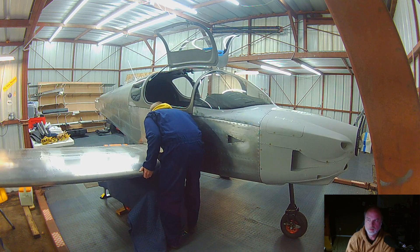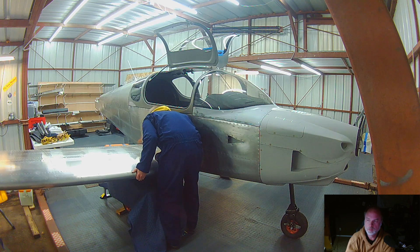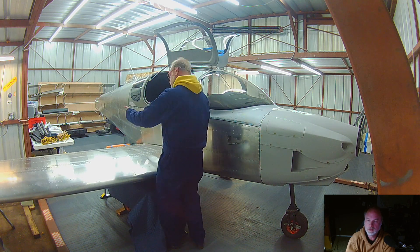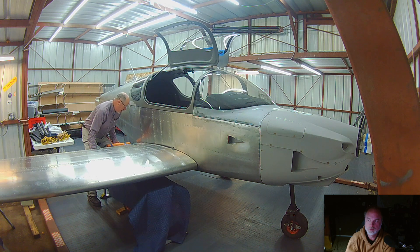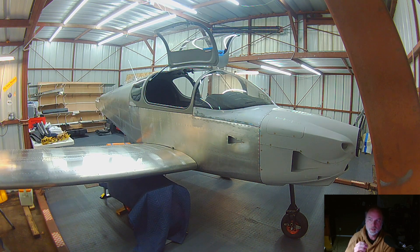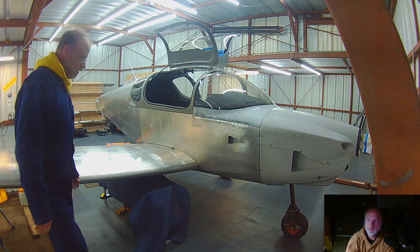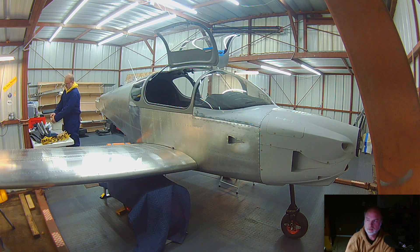When we did the left wing, we missed that a little and it bent slightly, but we bent it back into place and it was fine. The idea is to get it lined up close, then hop in the airplane and start guiding the bolts through. The first bolt is really the hardest one — even with the shrunken bolts — because that's where everything has to line up beginning, middle, and end. The instructions have the pattern of forward-facing versus aft-facing bolts; most face forward with the nut on the front, and one faces backward with the nut on the back.